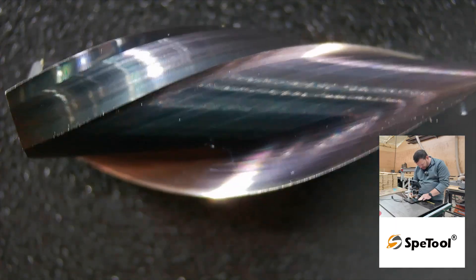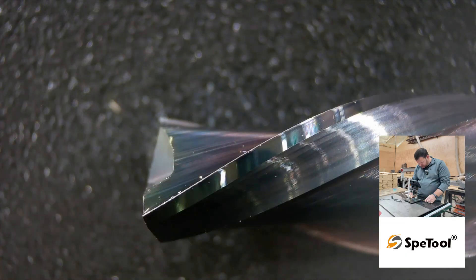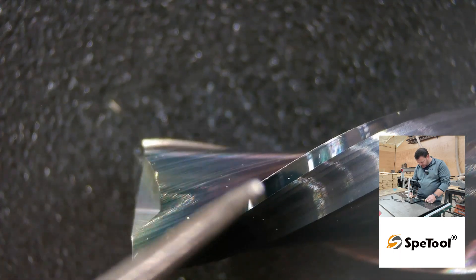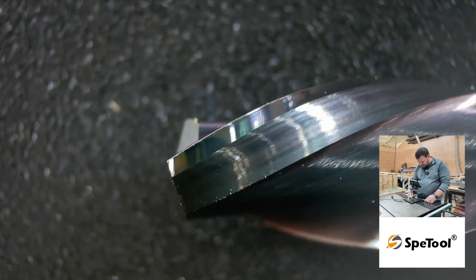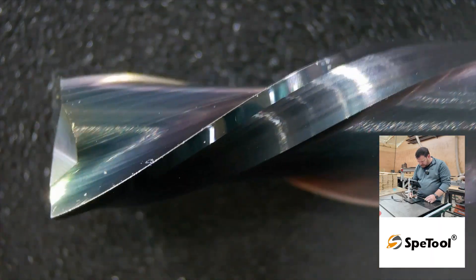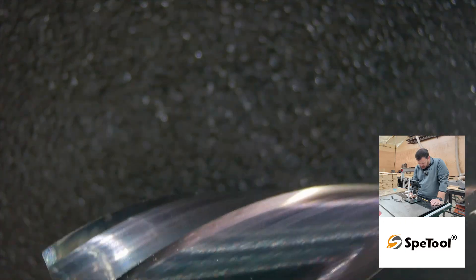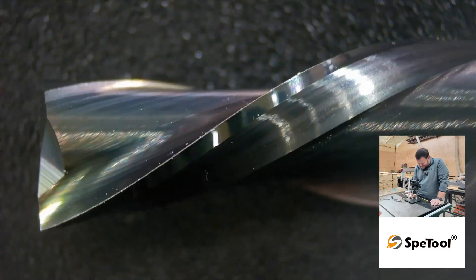Speed Tool after 150 trays under the microscope — where we did most of the cutting — you don't see any giant chips out of it, just edge wear. You just see it starting to round over. This is after five hours of cutting. The coating is definitely worn from the cutting edge, but it looks like it's evenly worn.